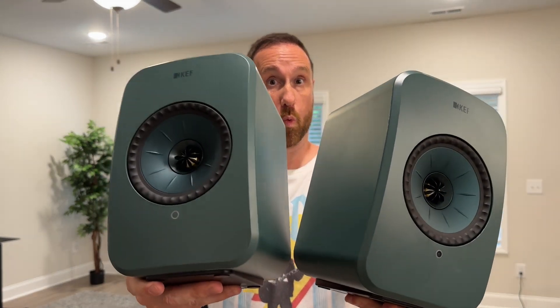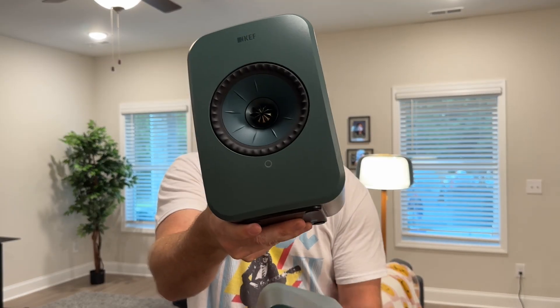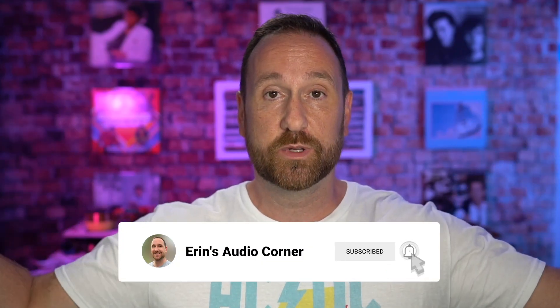Check this out — I'm holding these speakers. It's a small speaker. Overall, I like the sound; it does have that diffraction dip around 4–5 kHz. Aside from that, it's a pretty dang good linear speaker. The other thing that really matters is how it performs in a room. If you're sitting close to a speaker, you want the on-axis sound to be good. If you're sitting far away, you want the off-axis sound and reflections to be similar in tone to the direct sound, so they don't confuse your brain or blur imaging.